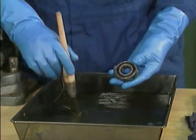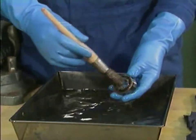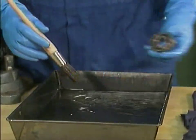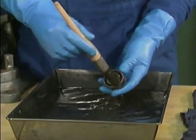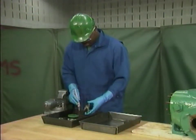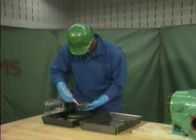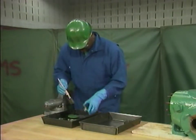When he's finished cleaning the bearings, he'll inspect them to make sure that they are free of foreign material, and that they're not chipped, worn, or otherwise damaged. Any imperfections in the seals or the bearings would be reported. When he finishes cleaning and inspecting the seals and the bearings, the mechanic cleans and checks the other pump components that he removed. If he finds any worn or damaged components, he will set them aside and request replacements.